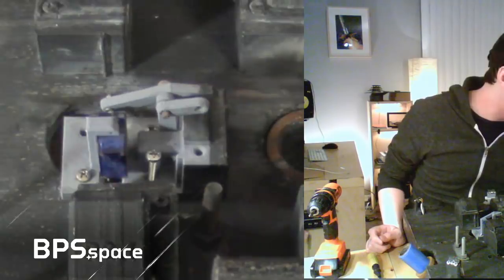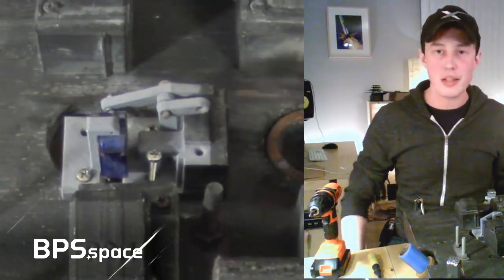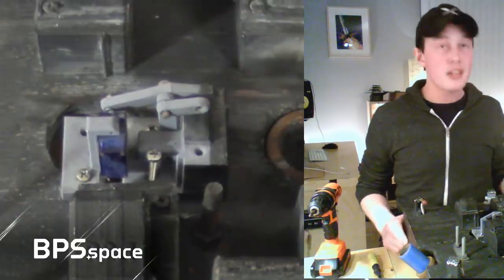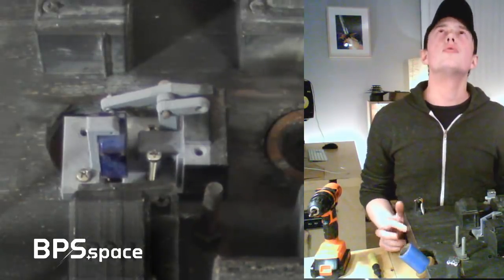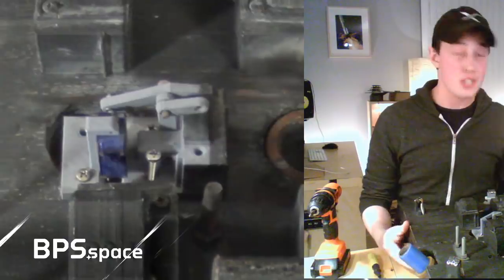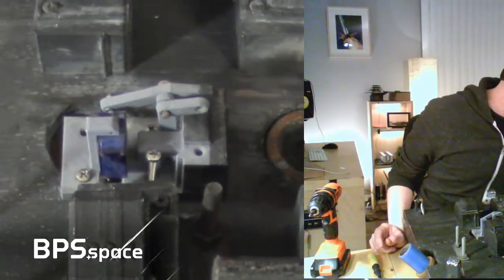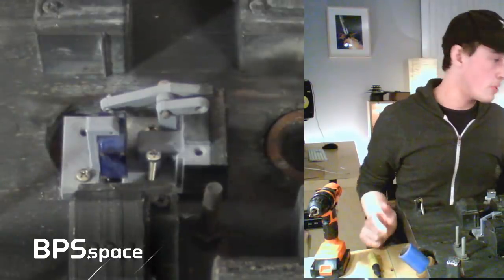Okay, so is it hard to make rockets and a launchpad? Will you make a Delta IV soon, or an SLS? I don't have any plans to do a Delta IV rocket or the SLS, but it is hard to make. It is a custom built PCB named Impulse based off Arduino. Full info at BPS.space. Thanks, Colin. Yeah, if there was a question about the launchpad computer, that's totally correct. It runs on an ATSAMD... ooh, okay, ATSAMD 256D21 or something. It's a bunch of numbers. It's an ARM Cortex M0 based on the Arduino platform. Most of my stuff is based in the Arduino environment, and most of the PCBs are custom. Okay, and the programming language is technically Arduino, but that's basically just a small wrapper on top of C++.